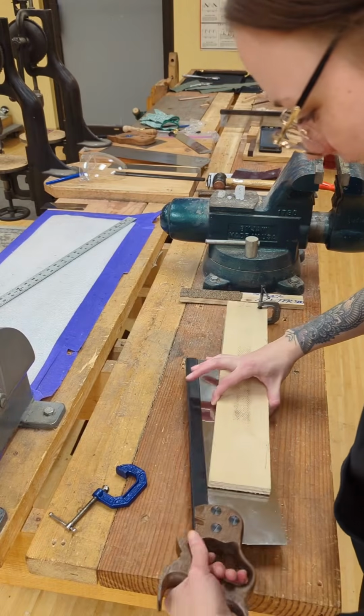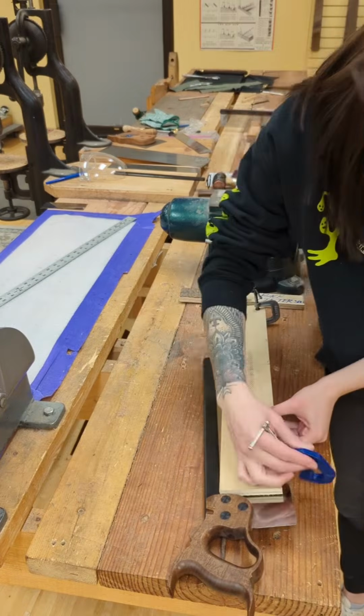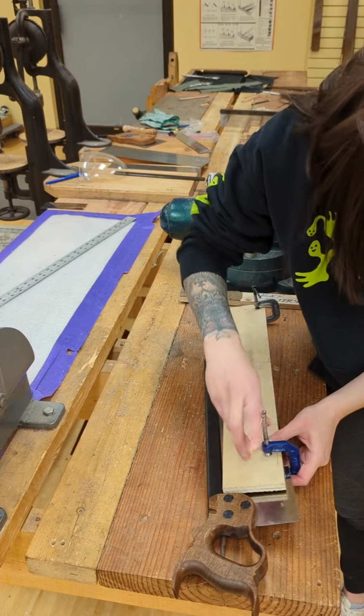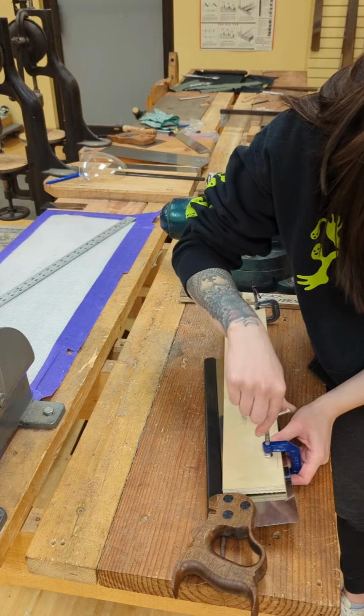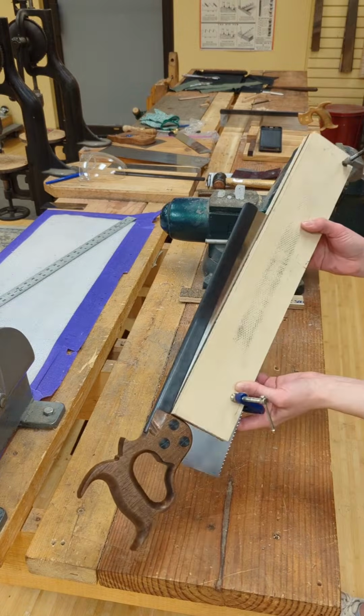I'm going to start by showing you how to make a minor back lifting adjustment for sawbacks that aren't completely bottomed out. We'll clamp our saw into the cork-lined work holding station using C-clamps. Before you lift the back, you may want to slightly loosen the fasteners to avoid unintentionally cracking your handle.